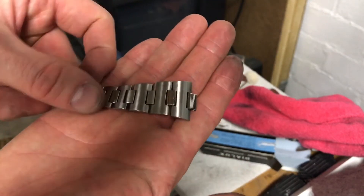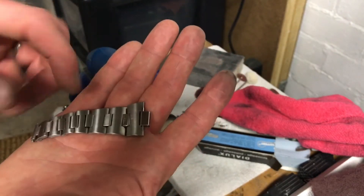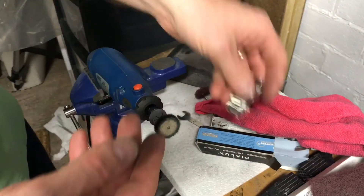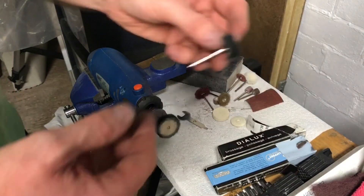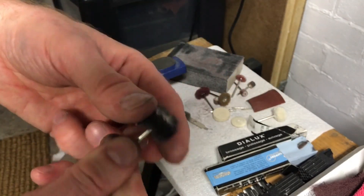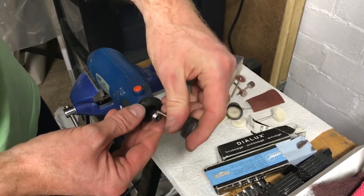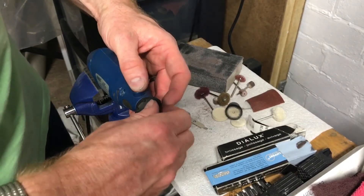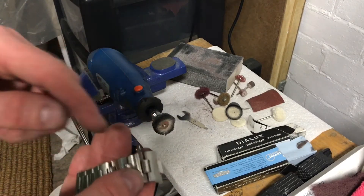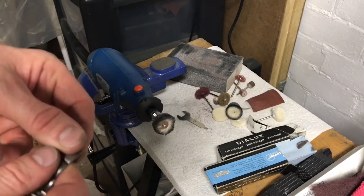They are a lot shinier already — probably doesn't come across very well on camera. What I will do is finish all these off, make it look pretty, and then take a photo so you can see the final result. I'll also show you the cotton wheel — this is just a used one. Normally you'd go over with that just to polish it up at the very end, the final flash. Really what you want to be doing is cleaning the bracelet between stages. I would normally put this in my ultrasonic, clean it up, and then come back. Any remaining grit in there could come out in the last passes and scratch it, and you don't really want that.